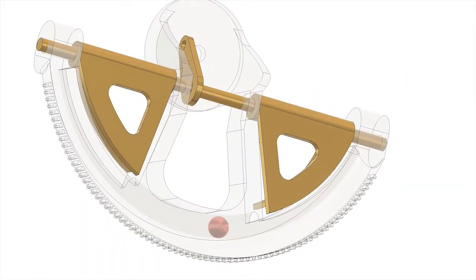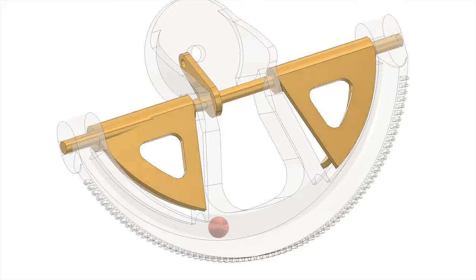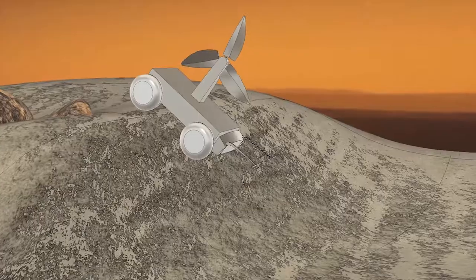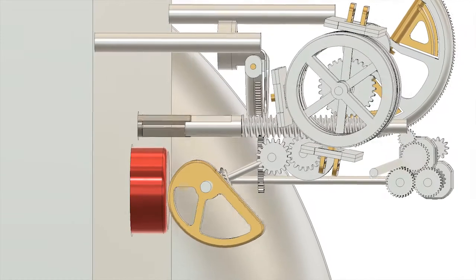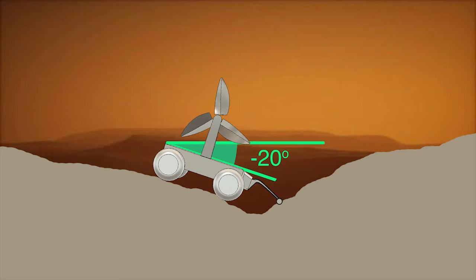It feeds these outputs back into the clinometers, which tip in the direction of the probe's reading. The Roach system checks these clinometers. If the rover is tipping outside of safe bounds — pitching forward, backward, or sideways more than 30 degrees — the system will alert the rover to reverse direction. For example, if the current pitch is downward at negative 20 degrees and the path ahead reads negative 40 degrees, indicating a steep drop-off, then the clinometer will read negative 60 degrees — way outside the safe range — and will alert the rover to reverse. Or if the current pitch is downward at negative 20 degrees and the path ahead is pitching up at positive 40 degrees, the result is positive 20 degrees, within the safe range — proceed ahead.